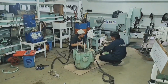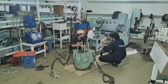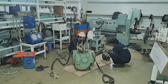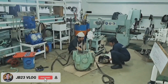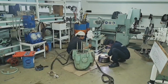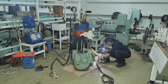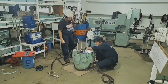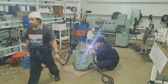Before assembling, we have to check the seats of the spindle and the valve — if there is considerable damage, it may need lapping or grinding. Before grinding or lapping the valve seats, we must ensure the ship is not in motion; otherwise, we cannot achieve 100% alignment. The ship must be at anchor when lapping. In this case, the condition of our seats is good and no grinding or lapping is needed.